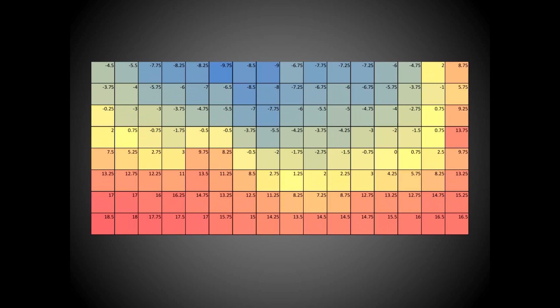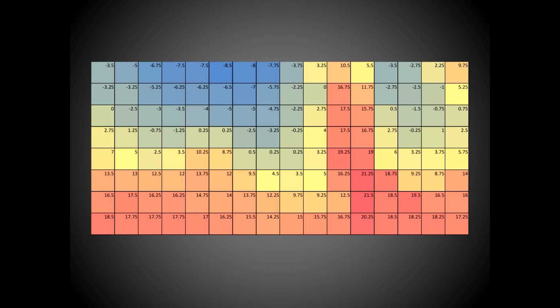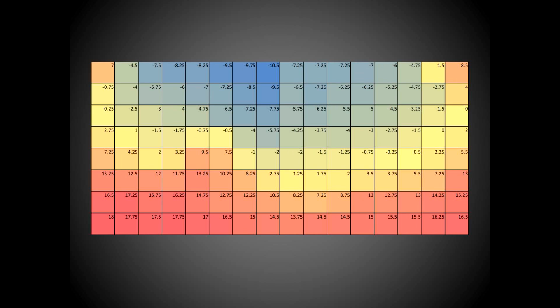If we look at a few frames of data as I walk in front of the camera, we can see that my body is not any warmer than the ground in some locations. Only as I walk into the middle are my legs a few degrees warmer than the surrounding ground, and this is only because I'm wearing shorts. Using the maximum temperature turns out not to be a good algorithm for detecting a person in this scenario.